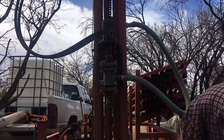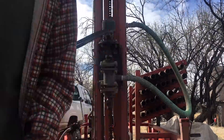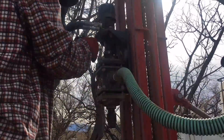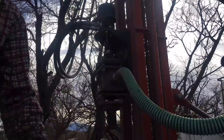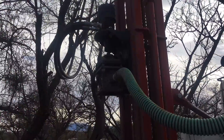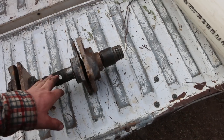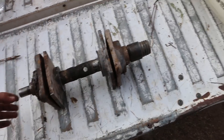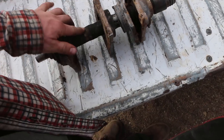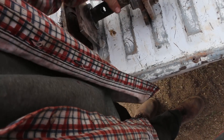It's time to pull this thing apart, see what I can rebuild, and get it working a little bit better. Here is the center shaft — this is where the water comes in and then it flows out down here. I think what the issue is, there are these huge grooves in this pipe. It's rubbing on there and it's just pouring out.